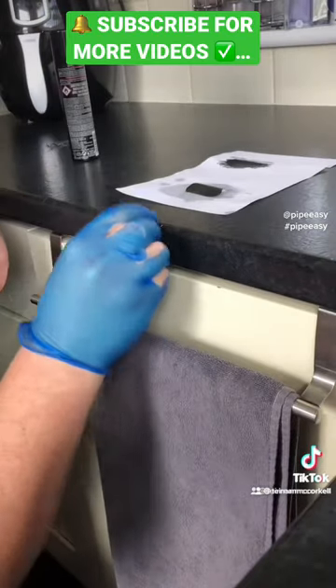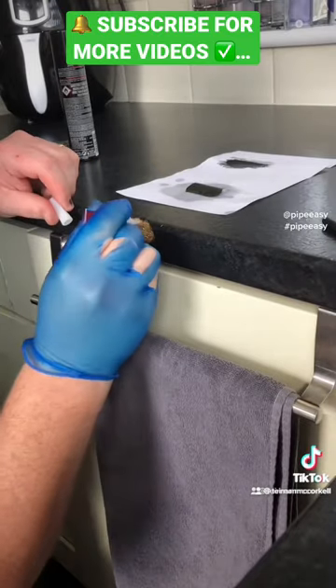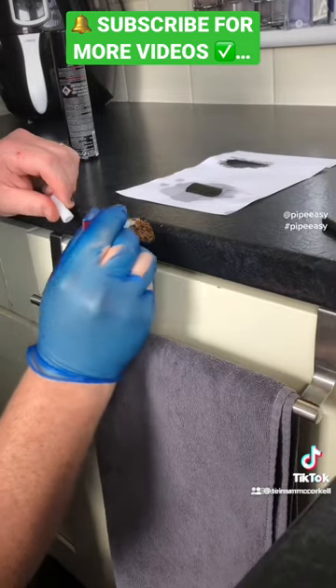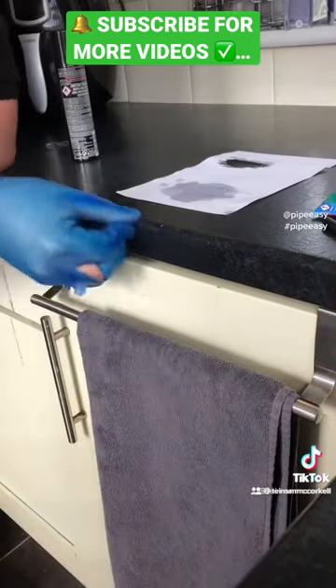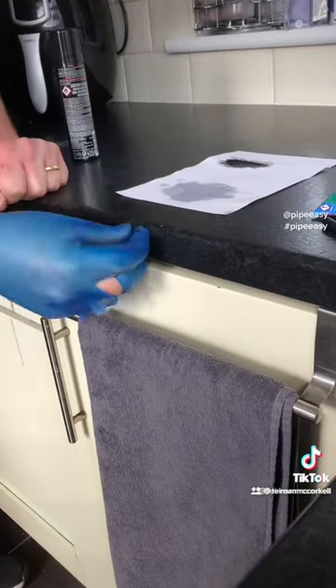Hairspray. Now we're going to touch up around the outline of our damaged worktop using super glue. We're going to try and cover the whole area of the space but not quite up to the edge. Once dried, get your template, pop it on top and then simply touch up with the same black crayon.